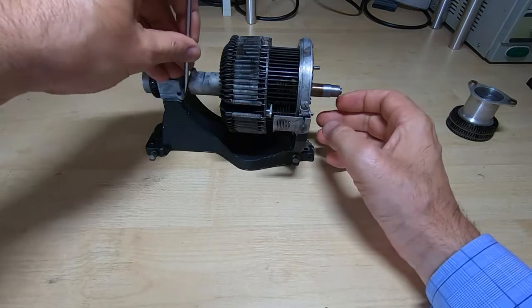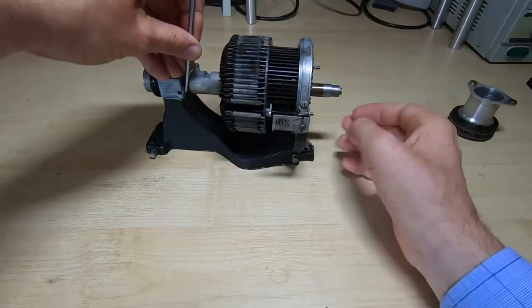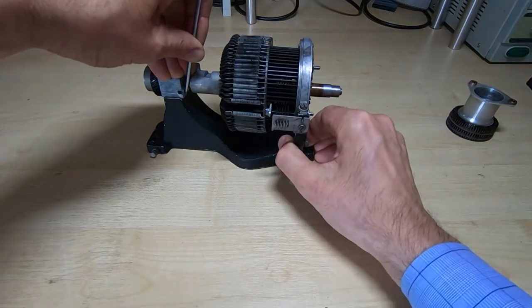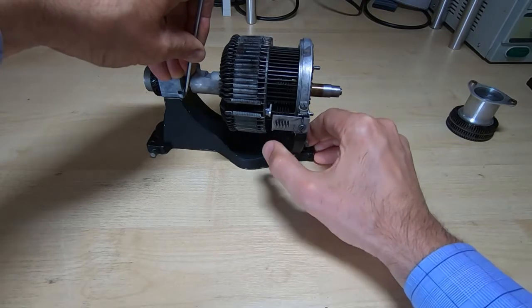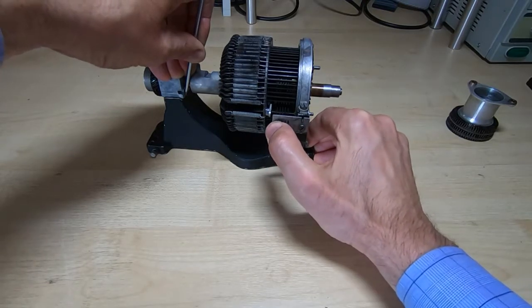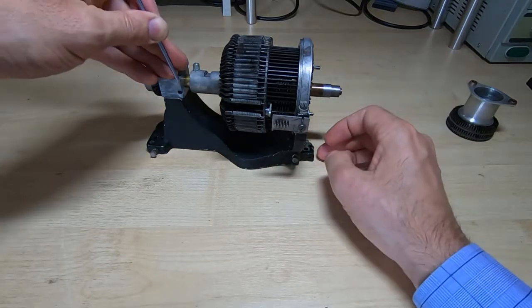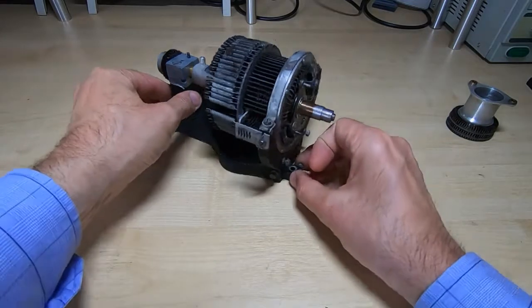The machine can then of course select different characters by simply repeating the process but setting different values on the pins. So if I push this in, you can see they all go down, so their default position is down. They're pushed up in whatever combination they're required. This is released, and then that selects the pin, and that in turn selects the character that we want to print.